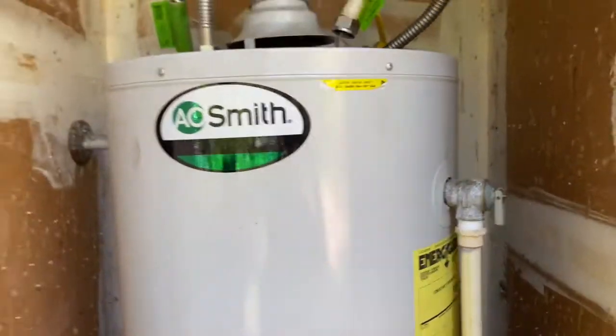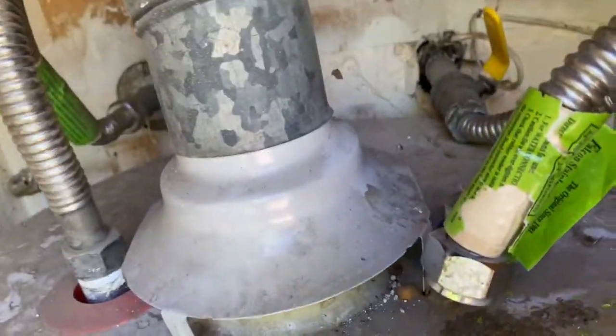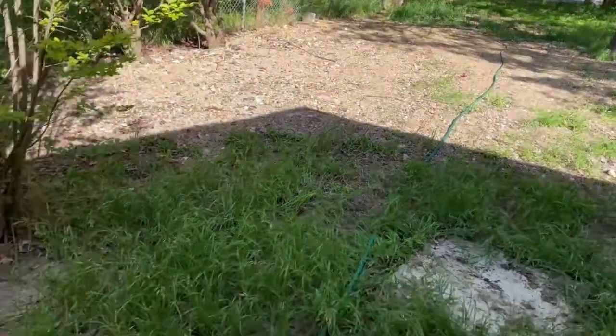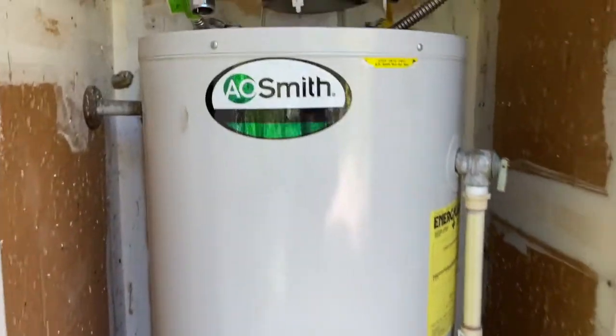So yeah, we've shut off the water to the whole place because the shutoff valve right here doesn't work. And now we've unscrewed that to let it air out. And we have this water hose draining the rest of the house. I'm going to take the rest of these pipes off, and then we'll go. Okay, now I've got both of those hoses off.